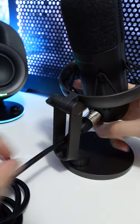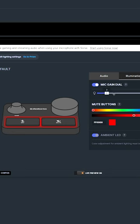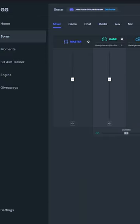After I plugged in the XLR mic, I connected my Type-C to my PC, the power adapter into the stream mixer, then turned on the device. After a quick setup in SteelSeries GG, turn on Sonar to access all of the mic settings.